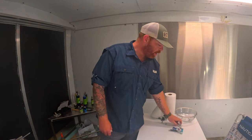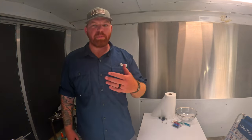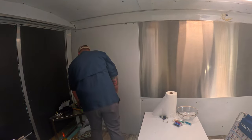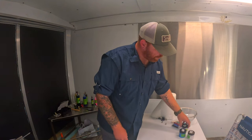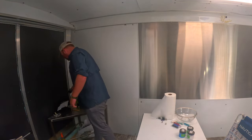Now, for the warmonger color, what it basically is is a white, a shimmer pearl with blue highlight to give it a silvery look, with gold, blue, and black flake. So we'll go ahead and grab all that stuff right now. Got our blue, our gold, our pearl powder, our blue highlight, and black flake.